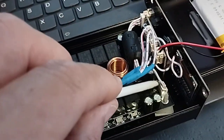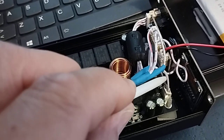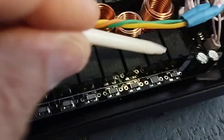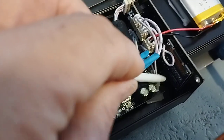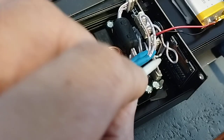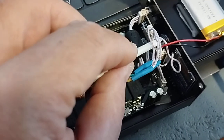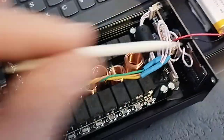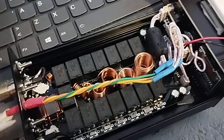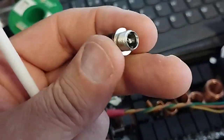Now there are two ways of doing this. You could simply take the power plus here off the main board, cut that cable. There's an earth symbol on the left — that one's ground on the left and on the right you've got power. So you could just cut that wire, wire it to a switch and either have it switched to the battery circuit power or to an external supply through a switch. You'd have to mount a switch somewhere and an external socket.